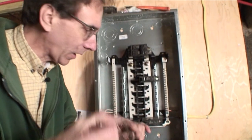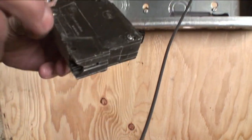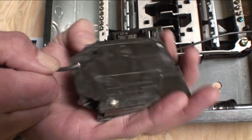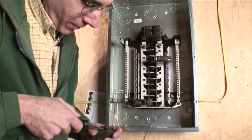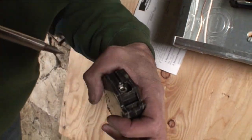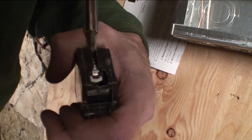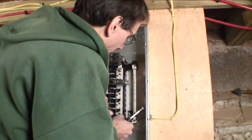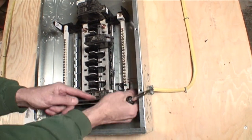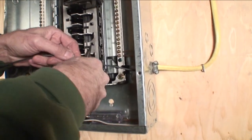One more wire to go — that's the hot lead going to our circuit breaker. Now let's take a look at the circuit breaker. See what it says there? It says 'strip' — that is the length of wire insulation we strip back, which is about a half inch, because that's going to go into here. If I loosen this up, see that little grabber inside? If I tighten that up again, the jaws close up and that's what's going to clamp the wire. So we're going to put this back in place, come out with a right angle, and cut the wire. This is the path of no return, so we'll cut it a little bit long.